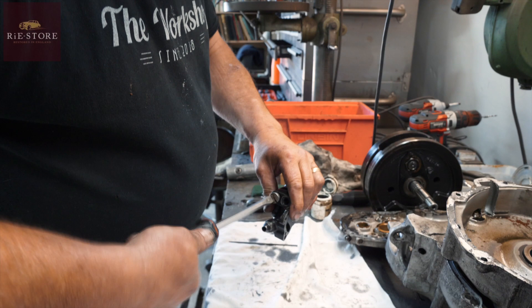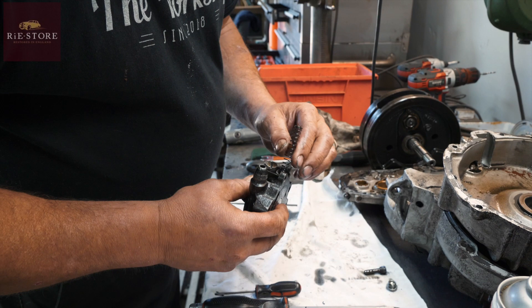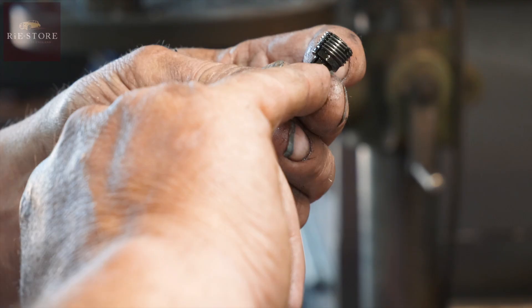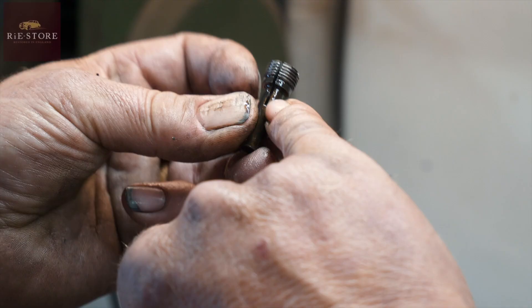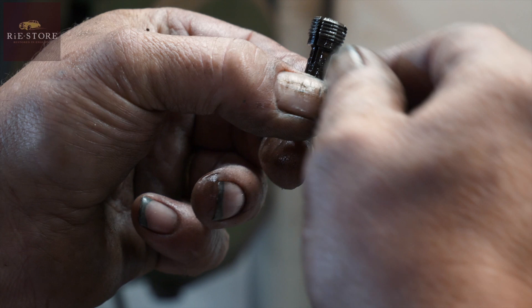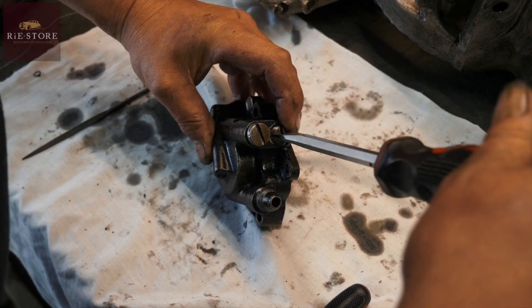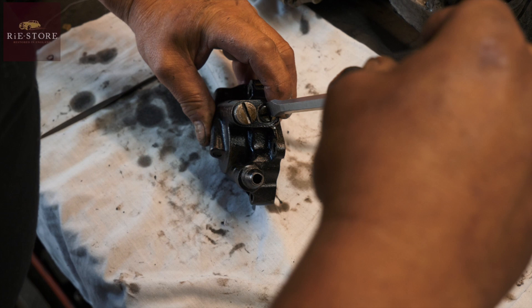This is the only one that matters. Ball bearing goes in, spring goes in, cap goes on — but look: one has got a slot all the way down, and the other only has a slot down partway. When you're doing it up, don't put the screwdriver in the narrower long slot, because it will force the screw head open and you can't tighten it. Always go in the big slot when doing it up.